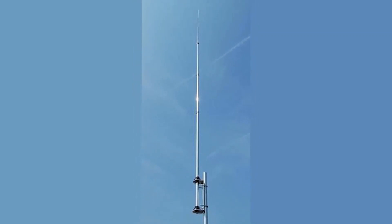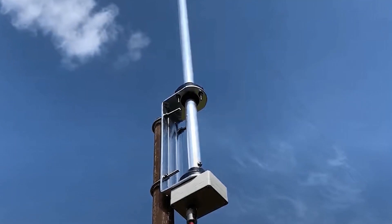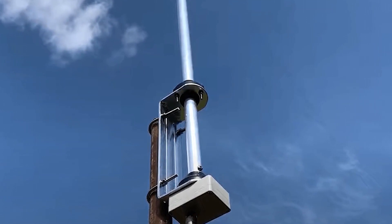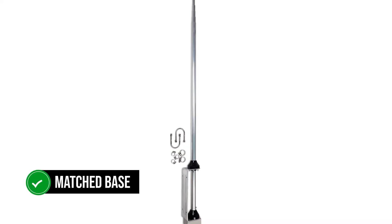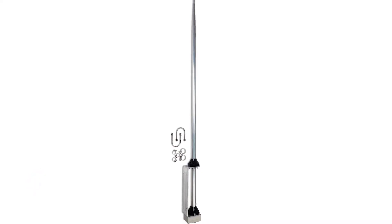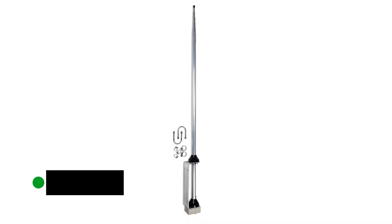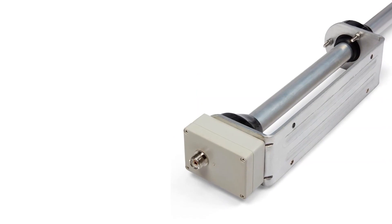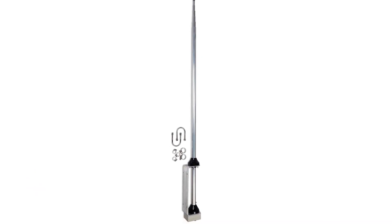Adding a radial plate is effective as well, but the UnUn will need closer attention. If you're aiming for a similar setup, the radial plate and UnUn need to be purchased separately, though the antenna has a matched base. That said, some sellers and antenna packagings include a Balun UnUn in the box, which can come in pretty handy. Overall, the Moonraker GPA80HF antenna is a good choice for those who want a budget option and have limited space for the antenna.